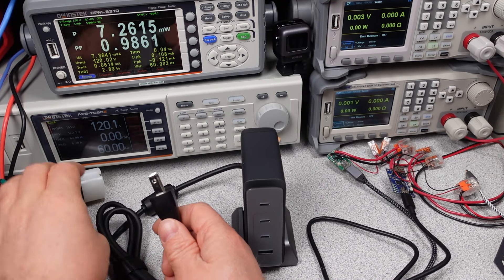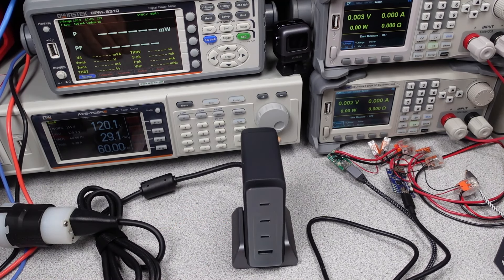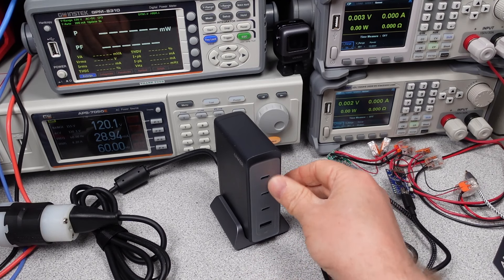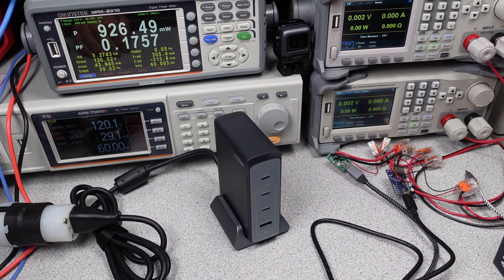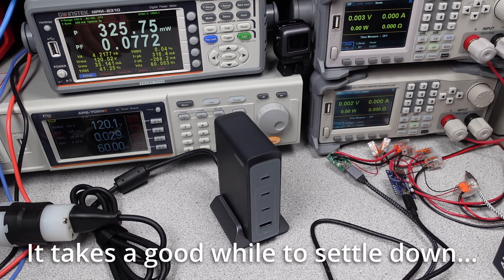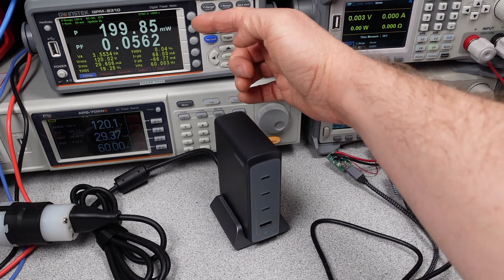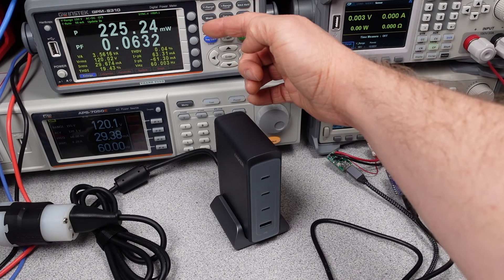This exceeds the requirements, but who cares? Efficiency and idle power usage — these numbers are tiny and insignificant on my electric bill. Well, it's more of a big picture problem than a small picture problem. The issue is there are easily a billion or more devices plugged in in just the USA. A billion times 0.2 watts versus a billion times 0.1 for idle power matters. For efficiency, a billion times the loss at 89% versus a billion times the loss of 91% efficiency is huge. So it's small, insignificant — really meaningless on a one-person case — but times the planet's population, this matters. And Anker did well here, making one of the best performing products on the market for this power level.